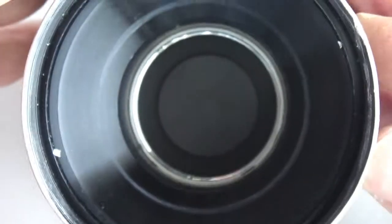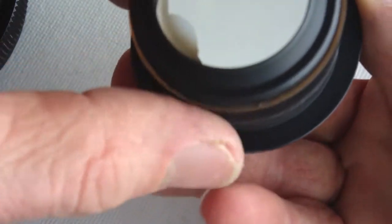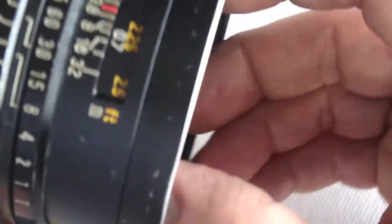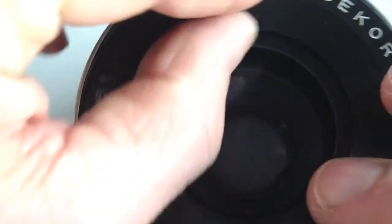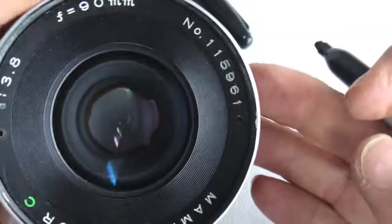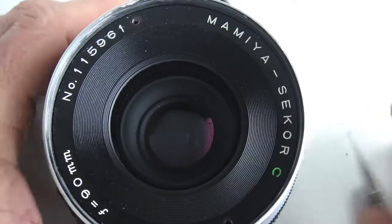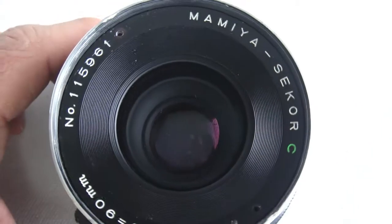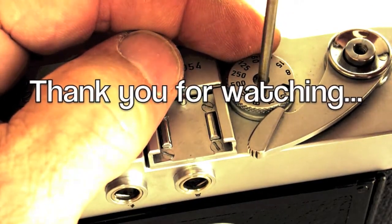And with that, install the filter ring housing. And almost finally, the lens assembly with the spacer washer in place. And finally, that stubborn nameplate ring. Take advantage of the newly drilled holes to use the spanner to tighten it. Although the cosmetics on this lens isn't that big of a deal since it's a lens meant to be used, a little touch up on the newly acquired spanner holes wouldn't hurt. Thank you for watching. Inspired? Check back for new video postings.